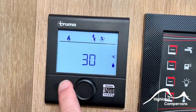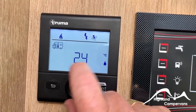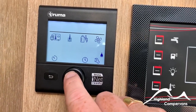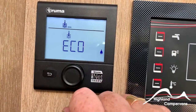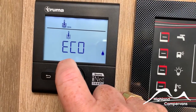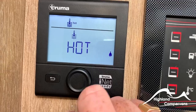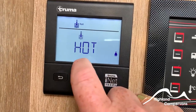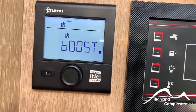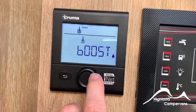Let's go back and switch the heating off as it's already warm. Next is hot water. Eco is about 40 degrees Celsius — plenty for washing dishes. Hot is about 65 degrees — plenty for a shower. There is also boost, which heats the water at the expense of energy going to central heating; it won't get any hotter, it will just get there quicker.